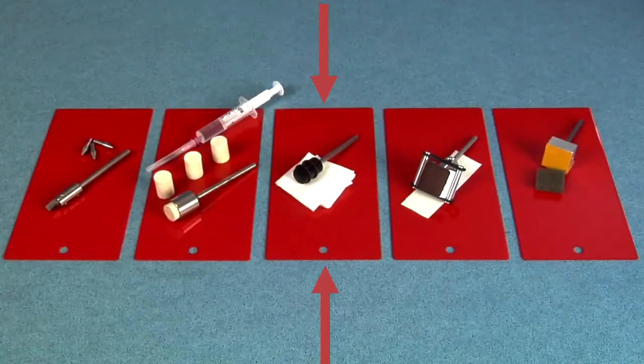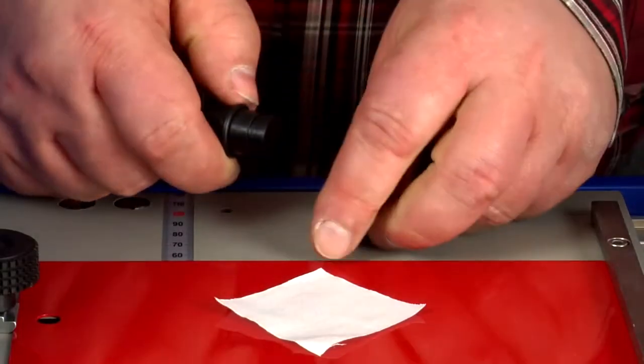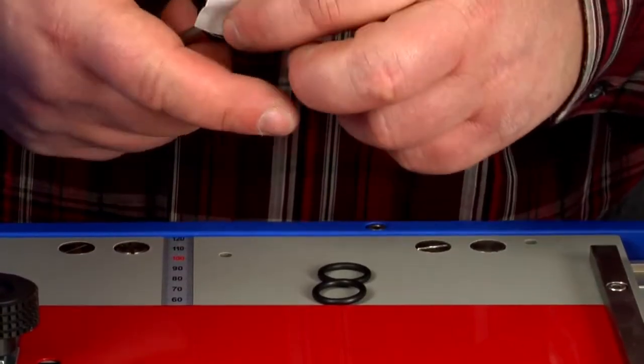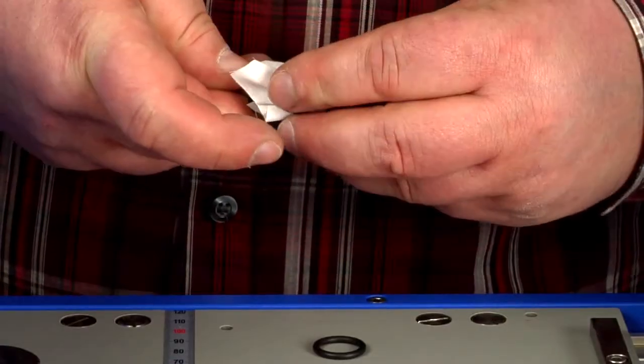The well-established classic crock meter works with a cylindrical head covered with a defined white cotton cloth. It enables the user to assess the grade of possible colour transfer from the tested material to the cotton fabric. In end-user reality, this is especially important for car seat fabric.